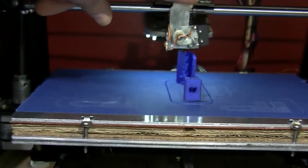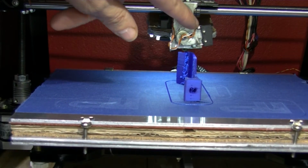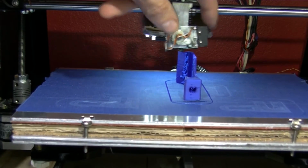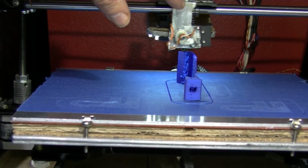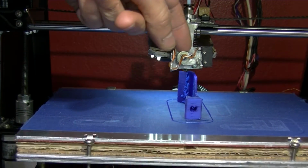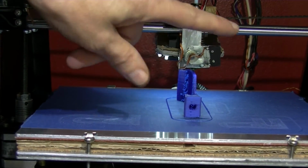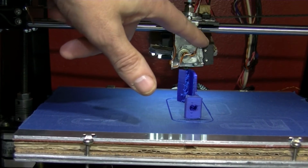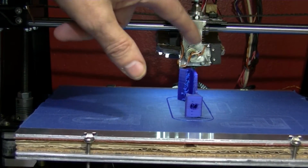This is basically to replace my manual Z probe height thing I have here, which I have to tilt up and down. This is just a micro switch on some computer expansion ports. A bolt through there, there's a spring on here, so that will press the two plates together, and this can swing up and down. This works quite well, very well actually. Only trouble is I have to do this manually.